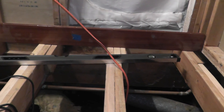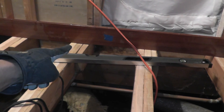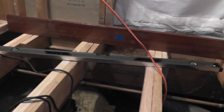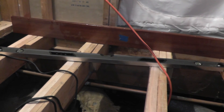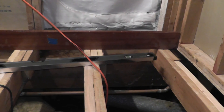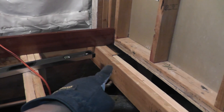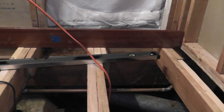What you see over there, for example, was about three-sixteenths of an inch off if I remember correctly. Now I've got it down to about a sixteenth of an inch, which is within tolerance. I'm not going to get too carried away with sanding these joists down because I don't want to take off so much material that later on I'm looking and going, uh oh, this isn't quite right. That corner is about a sixteenth of an inch off, so I think that part is good now.